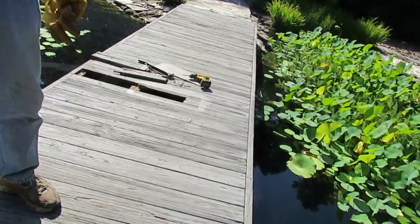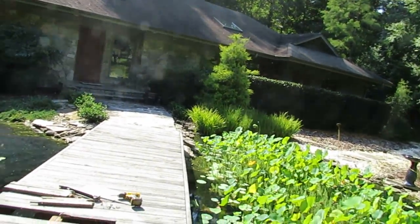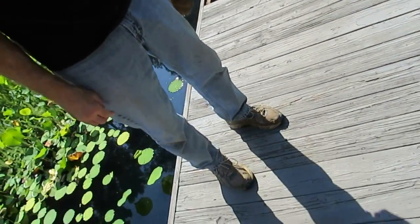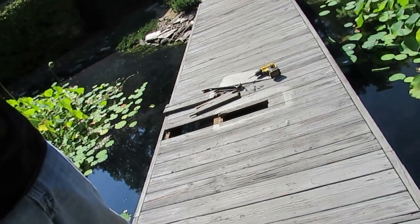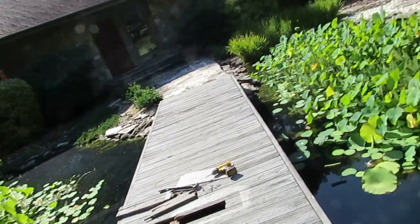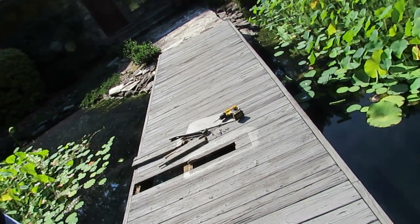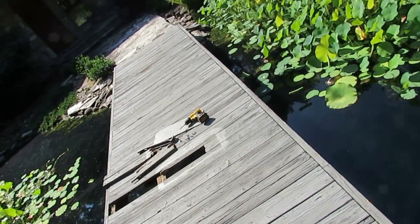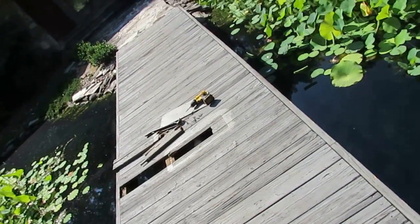The i-beams are holding the house up, not that board, but I'd still like a single piece. I will never put a nail in a piece of deck at your house — I'm going to pop chalk lines using yellow chalk that won't stay for a hundred years. I won't use red or blue. That gives me a straight line so the screws drop exactly where I want them. The yellow washes off real quick so it won't hurt your ecosystem. The decking I use is dried already so it won't shrink. I use Prime Guard screws — deck mates are my favorite — it's a star drive. I'll leave you a couple extra. Star drives have a lot of extra surface area, not like Phillips which has minimal surface area.